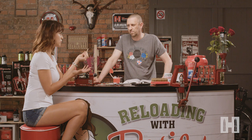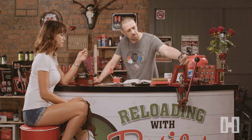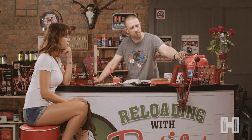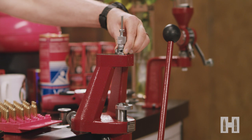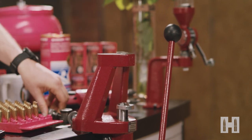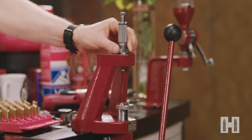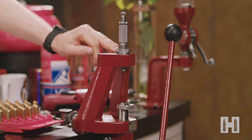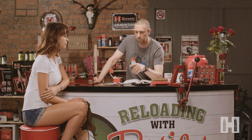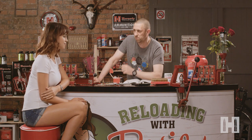Since I'm keeping the same depth, this will take no time at all. Exactly. The benefit of the lock-and-load system is you twist and it comes out. Earlier you used the full-length sizing die, which just drops in - that's what you use to size all your cases. One twist and out it comes. The seating die, which you just used, is now set to your depth. Drop it back in the press, one turn, and that's the perfect depth. Next time you load a set of rounds, take the first case, measure it, get 2.8 again, confirm, and you're good to go.